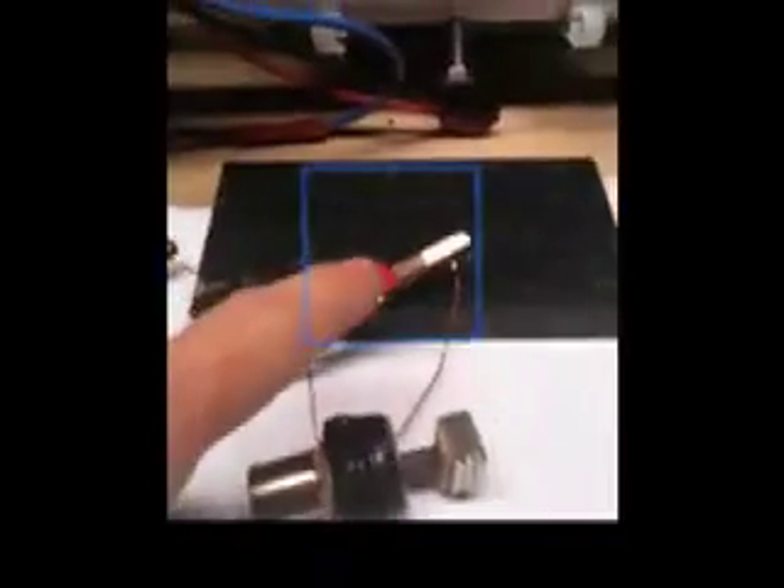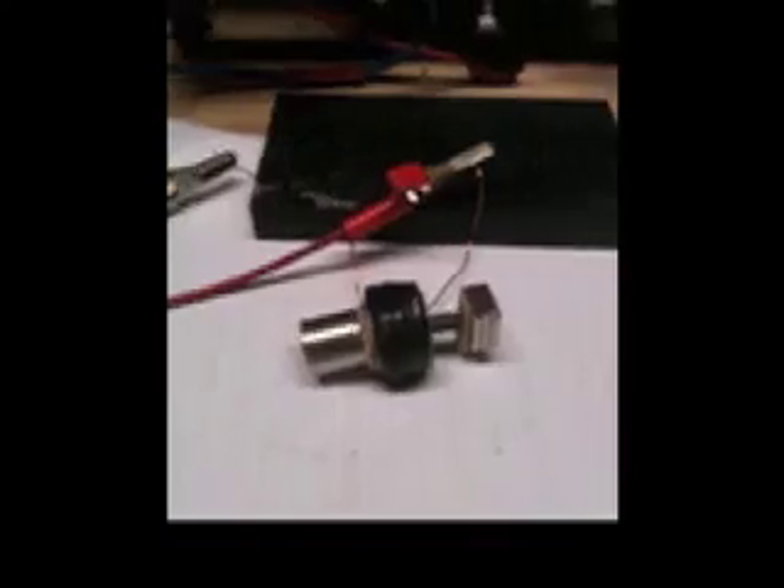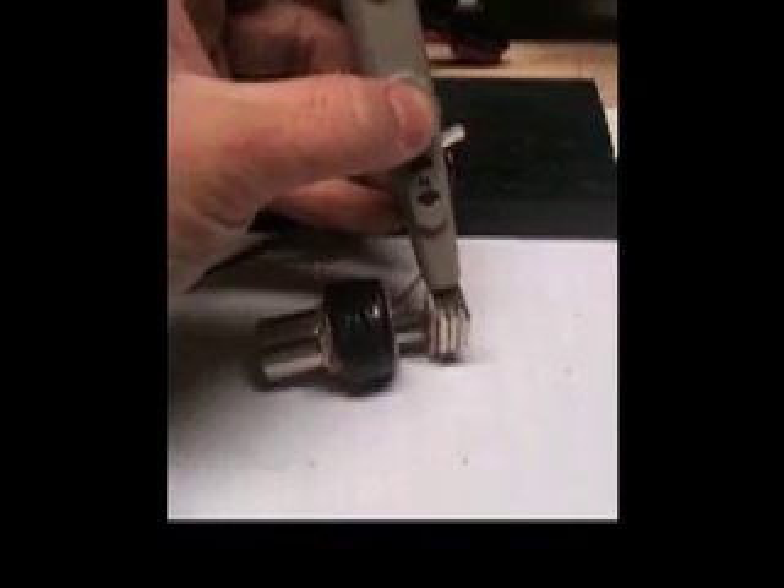I have flipped the bias magnets. Again, we are at 0.77 amps into the electromagnet. We should have south, north, and then south, north. Let's just double check it — south, north, south, north, north. I will shake up the requisite mineral oil. And again, electromagnet is on both leads. And we will watch the field.